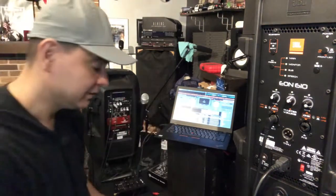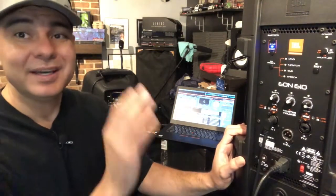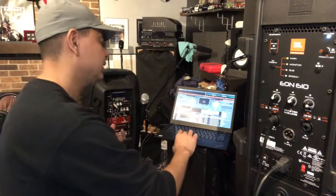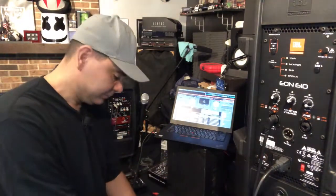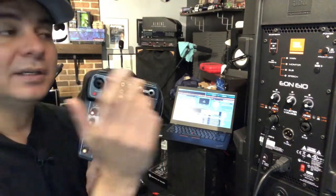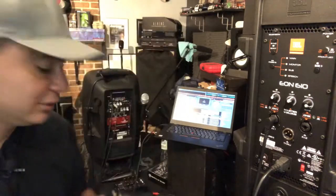What's cool about this little studio mixer is it can get power from the laptop via USB. I'll fire up the JBL — it takes about 10 seconds to boot up; once the power light is on top, you're good to go. And you can see we're playing music — we're good to go. So: outputs go to your speakers, and your two RCA inputs from your laptop go into the middle input on the studio mixer. Very easy.